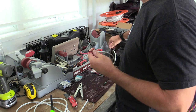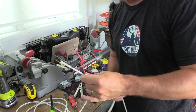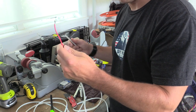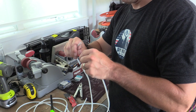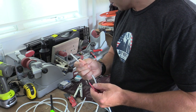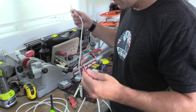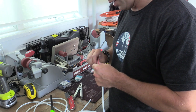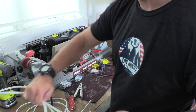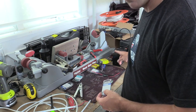Okay, we're going to let those cool off. I'm going to set up this wire to be the modular wire that I can plug into the power source here. I'm going to extend these out and match these two ring terminals, and then this end will have the male or female disconnects so I can plug it in and use it as an extension wire for a main battery on an outboard boat — like if you were fishing in Canada and there was no fish finder and it was just a small Lund or similar Alumacraft, and you didn't want to run your fish finder all day off this small battery.